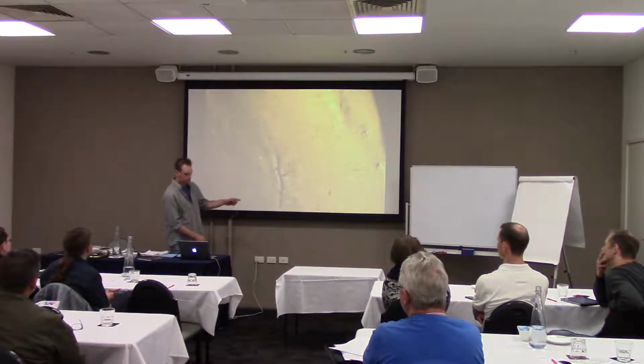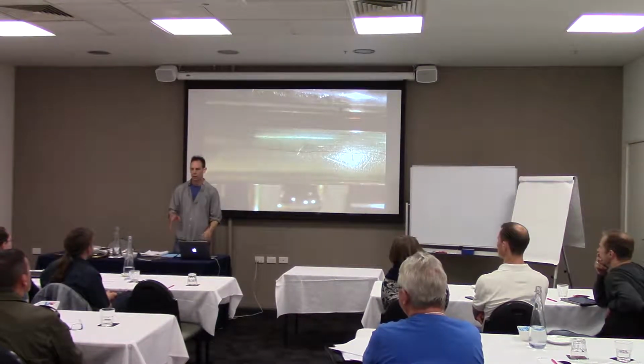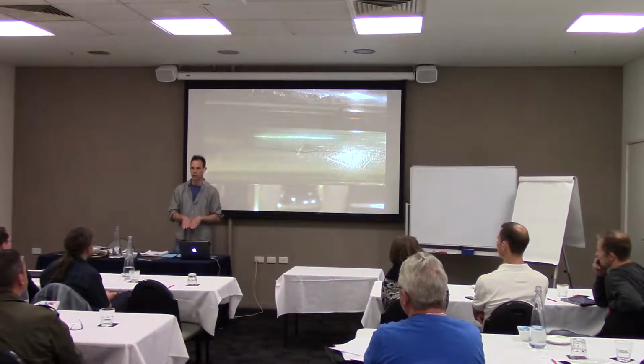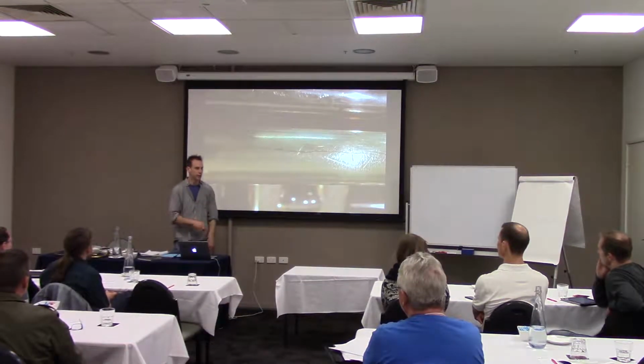Sometimes it cracks, and if you can re-anneal the area, then have you guys ever seen saddle patches? You make a U out of brass and lay it over the crack, then wire it on and braze it, and then just cut off the bit, and it actually gets down into the crease a little bit. So to repair that, either that or you could lay a wire on it. You're going to change the diameter, but I think this one's pretty messed up.